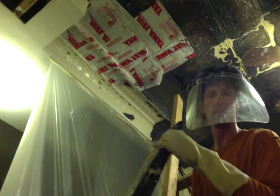Foam rubber is what I wanted to use, but I couldn't find a place that would sell that reasonably priced. So what I ended up with was some fiberglass insulation. I basically just put 1-inch thick fiberglass insulation on top of this. I wrapped a trash bag around it, and then I taped it underneath, and that seems to hold it in place. And it gives a flexible surface on top, so it has a little bit of give. The 2x4s warp a little bit. Your ceiling probably isn't perfectly flat, and so you need something that has a little bit of give. But I found that the fiberglass does pretty well. If you've got some foam rubber, that'll work well too.